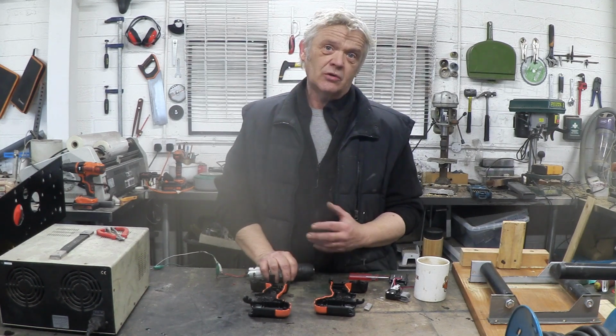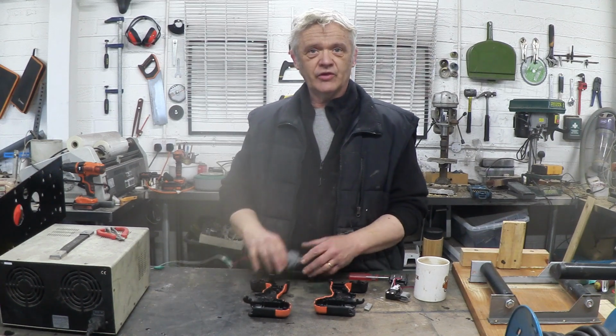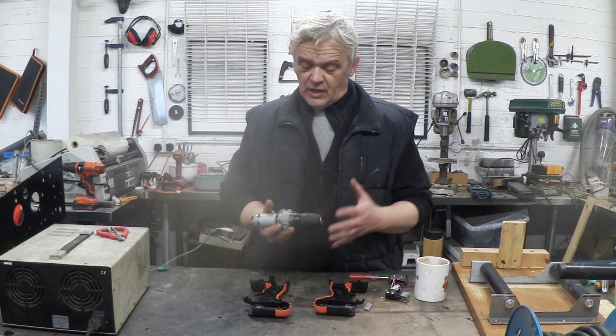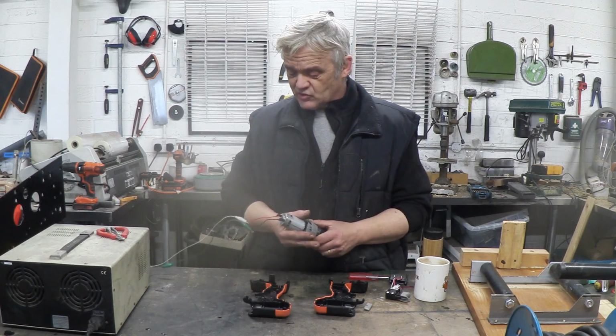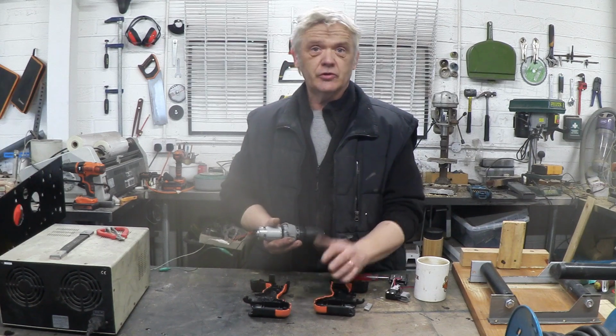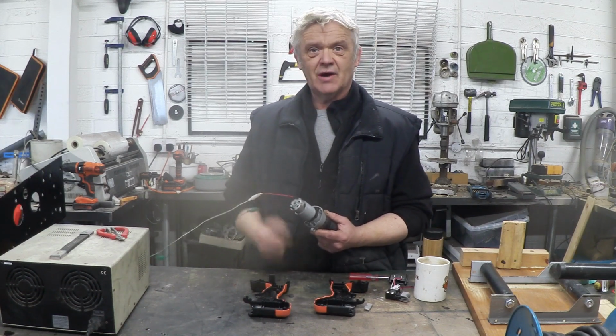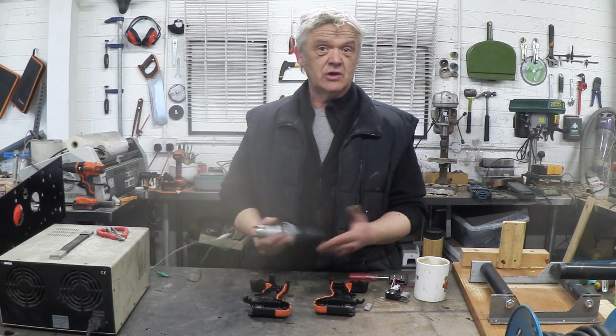And like I say, I've seen a whole host of projects from boats to bikes to machines all running on these little motors. So if you do have some of those things, like I said, don't be afraid to take it apart and use it. Don't forget the case is very usable, the switch is very usable, and they're dead easy to drive. Attach the plus and the minus of DC and vary the voltage. You're going to be on a winner.